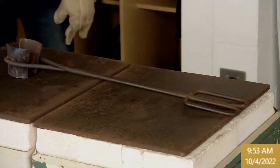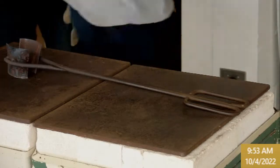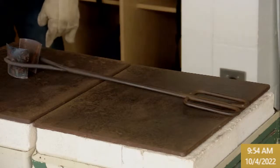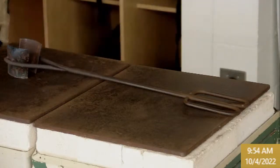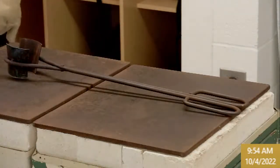This looks like magic, but it's not magic. These are cross polarizers. And so when they're held parallel, it doesn't look like anything but just regular plastic. But when they're held perpendicular, notice I can turn my face on and off, right? Can you see that? It looks like magic, but it's science, obviously. These are only allowing vertical polarization of light. When both are vertical, nothing cancels, but now it's vertical and horizontal and it cancels everything. The cool thing is if you put that on a light table in a cross polarized format, what you put between will have all these crazy colors based on how it polarizes light. And it turns out that glass and plastic and anything that's clear can polarize light if it has an internal stress field. And so you can see the result of the internal stress field by putting the glass on that cross polarizer stage there. So we'll take a look at that. It'll probably be an hour from now, but after a little while.